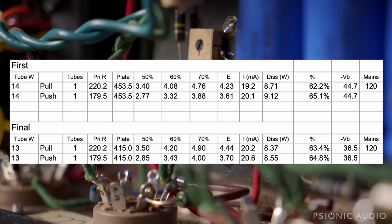JJs and Electro-Harmonix can take higher on the plates, like 475, but the screens still don't like anything up in the 450 range — that's just crazy hot. More importantly, once the B+ goes up that high, this circuit no longer sounds like an old Harvard. It sounds like a new thing; it sounds bigger, but doesn't behave the same as far as its overdrive, compression, and response.